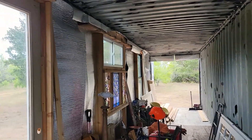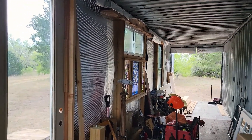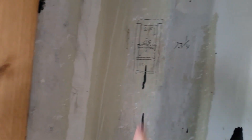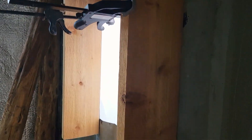I'm not going to varnish anything, but it'll look really nice. The linseed will let it last a long time. This is my methodology: I just measure it up in place, transfer it on the walls, transfer it to paper, and then cut the wood according to size. I should be done with this tomorrow.